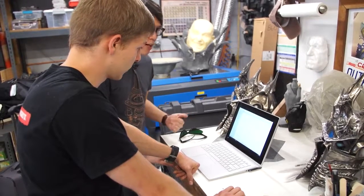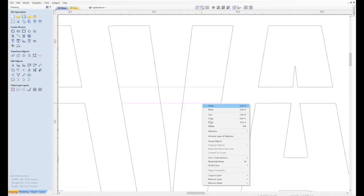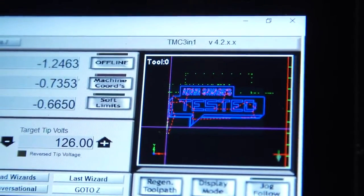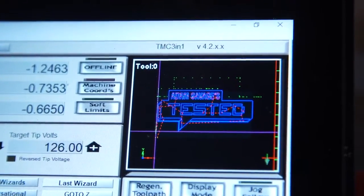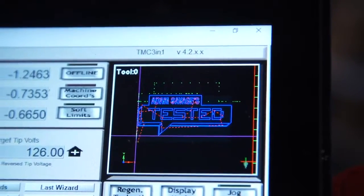So when you're done with this, what type of file are you sending over — back to Fusion 360, where does this file go? You'll use the CAM side to generate some G-code, and that G-code will be executed by Mach 3. And that G-code is generated right in VCarve? You can generate it in VCarve, SheetCam, or Fusion 360 — all of them have plasma options.